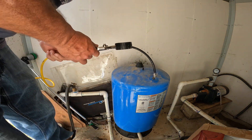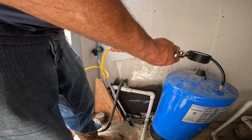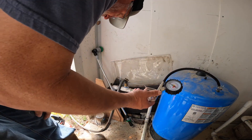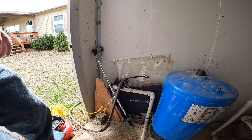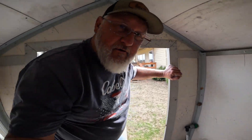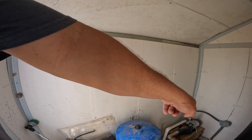We're there. I'm going to turn this spigot off so no more water goes out. Now I'm going to pressurize this tank to 38 pounds. I'm going to let this compressor build up. I'm going to pressurize this to 38 pounds because that pump kicks on at 40 pounds.